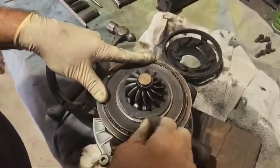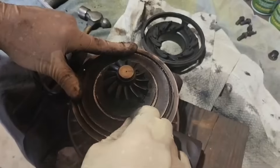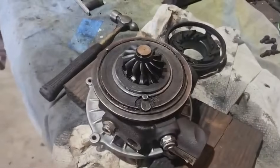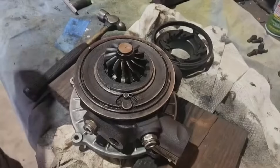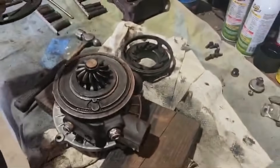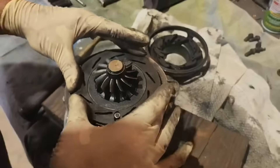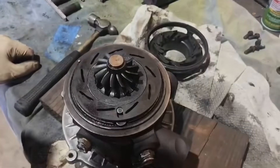I have the lever freed up nice and free again — you can turn this back and forth. It only goes through a small arc, but it goes all the way over both ways. PB Blaster works wonders on that. I used a conditioning disc — a roll-lock medium grade version — and it only takes about five to ten minutes to clean that surface up. I cleaned this up with a grinding disc, and now if you put this on here — before, we had to chisel it off — now it's nice and free. There you go. We can start the reassembly and save ourselves about twelve hundred dollars. Thanks for watching.